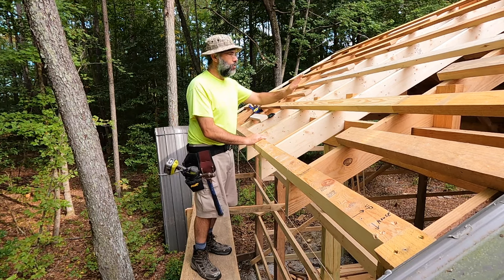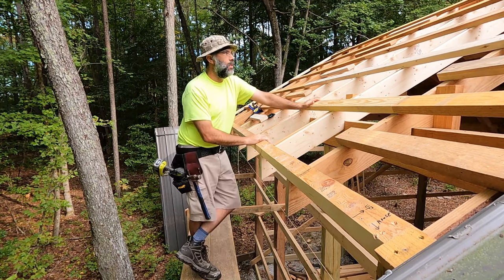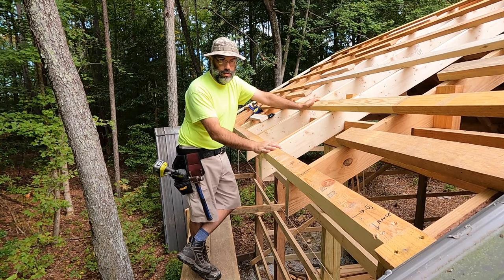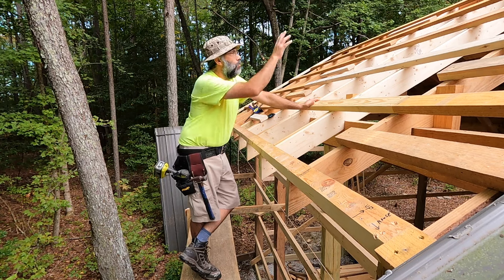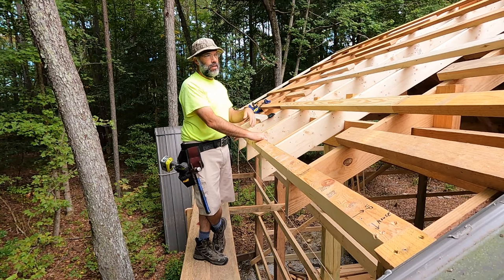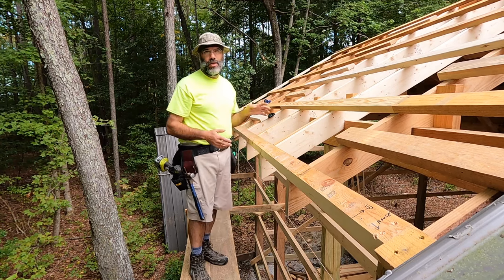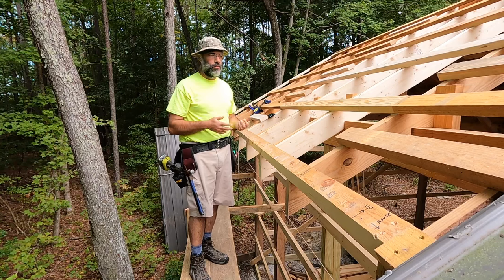As part of that process, I went through and replaced a couple of the purlins which had taken a bit of a set when those rafters drooped. The ones up top were okay, but these middle three purlins — that's new lumber as well — and got everything nice and straight, nice and sighted in. So this is an example of what can go wrong with green lumber, even if you do everything right up front in construction.